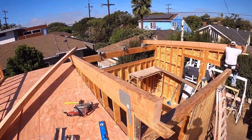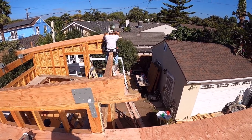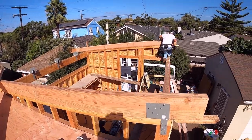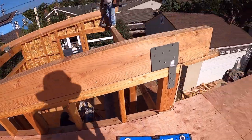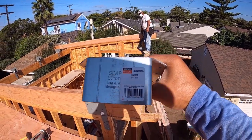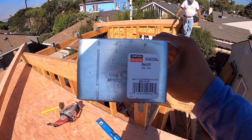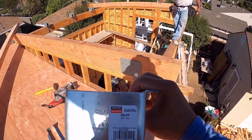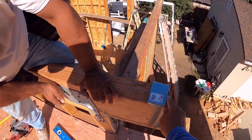In the middle there is a four by ten beam, and we will hang a beam here so it can carry those three beams and the roof in between. We are using a four by ten TF hanger — TF means top flange. The way we do this is put it like that.